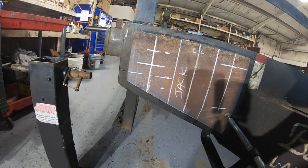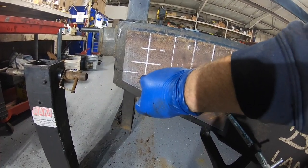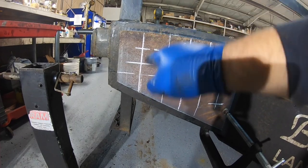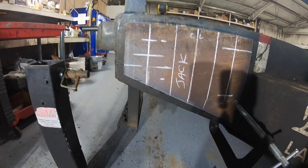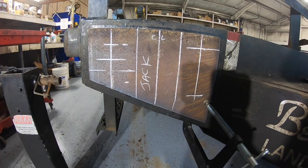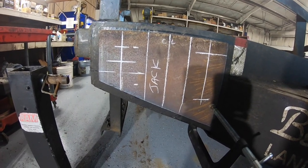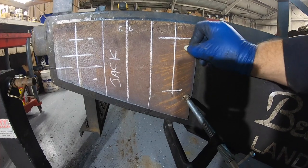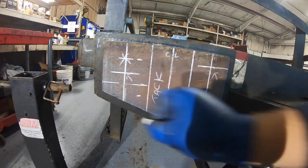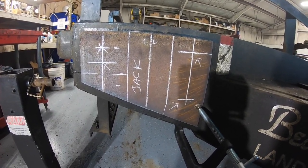The challenge is that behind the plate it isn't just one solid piece — there's a five-inch channel and then just sheet steel. I can't put my bolt hole right there in what would otherwise be a good spot because there's a piece of channel where the two things come together. I can't go through that, so I have to go either above or below it. I think what I'm going to do is use one bolt, center it right there — bolt there, bolt there — and I think that should be enough.